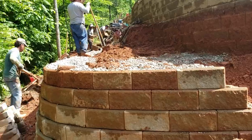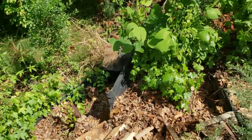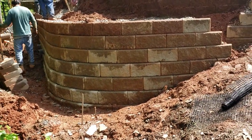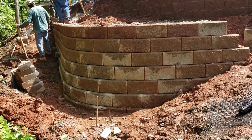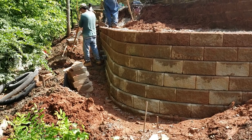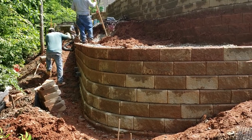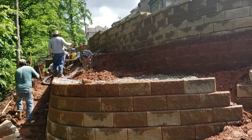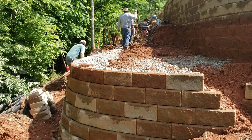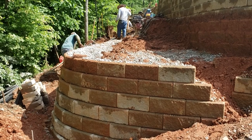The first thing was the foundation. Second, they put this black fabric — it's erosion fencing — behind the back of the wall without any gravel. Even if they had put gravel, that's the wrong way to do it. These walls are designed to let water out. We have foundation drains right there — it's a perforated pipe behind the wall connected to all that gravel. So the footing, the drainage, the whole thing was crooked, and these people just paid a lot of money to put this wall in about a month ago.